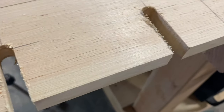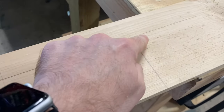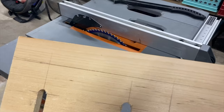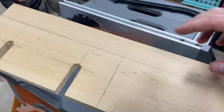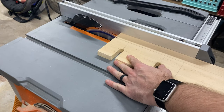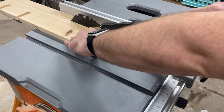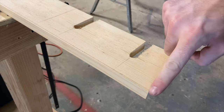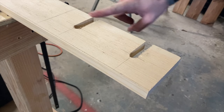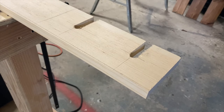Obviously these need to be cleaned up a little bit, but we can do that with the router. Now we'll go ahead and get the piece actually cut out and ready to go. I'm going to rip down this long side on the table saw, get this part cut off, and then trim this off on the miter saw. I've got the cordless Ridgid router. I'm going to route the front and inside of these while it's still on the bigger part of the board so I can have it clamped down, and then I'll get the other side once it's cut.